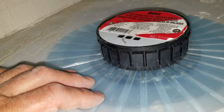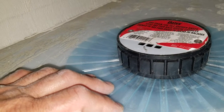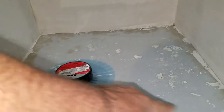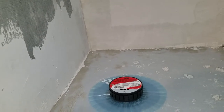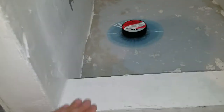We are going to get started on doing the guide sticks for laying out the mortar bed. They are just sloped from the corners into the center and they provide a quarter inch per foot slope. We did mortar everything last night - skim coated all the walls, and that seals up the walls better. Then you put your red guard on that - three coats of red guard - and then you are ready to do tile.